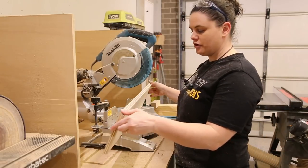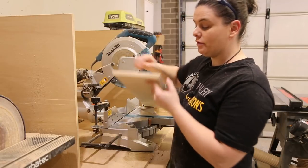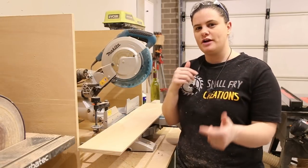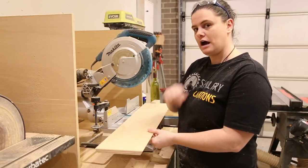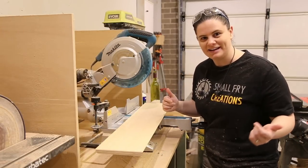I've got all of my strips cut. From my plywood I'm going to get three strips out of each for each triangle, so I've cut five strips in total. It's also important to note that my 30 degree angles run into each other like a picture frame, which means when you're cutting your angles on the table saw you actually need to flip your plywood after each cut and have the previous angle running up against the fence. I'm going to cut these to length at 250mm. I'll set up a stop block on my saw and get cutting.